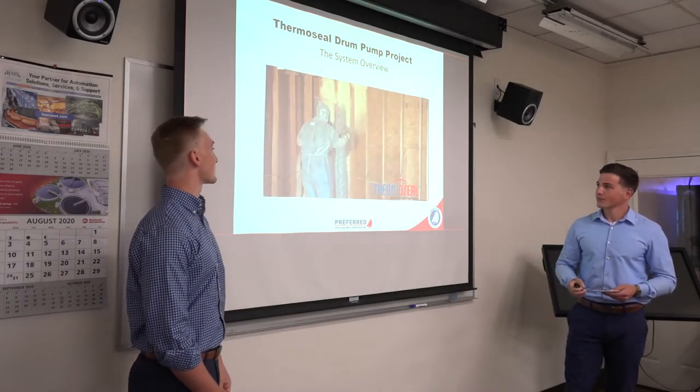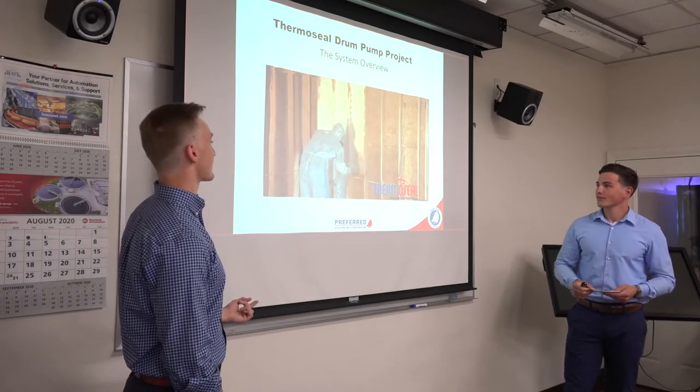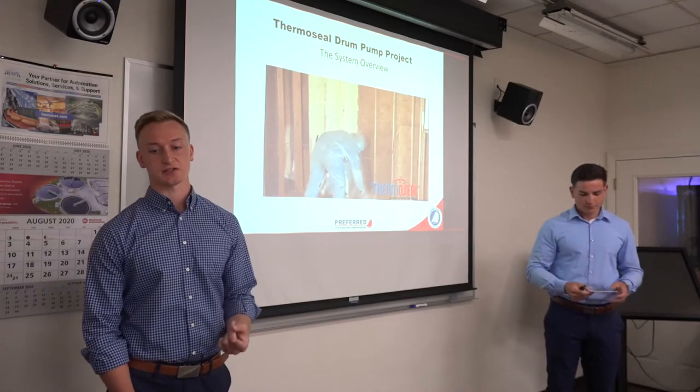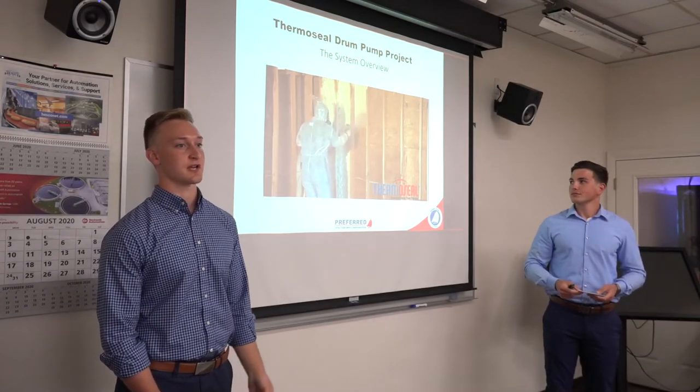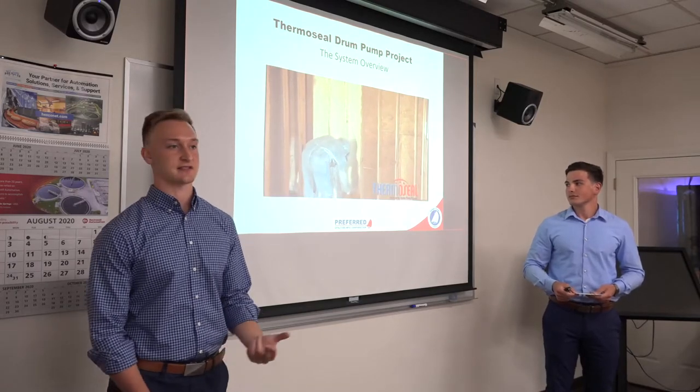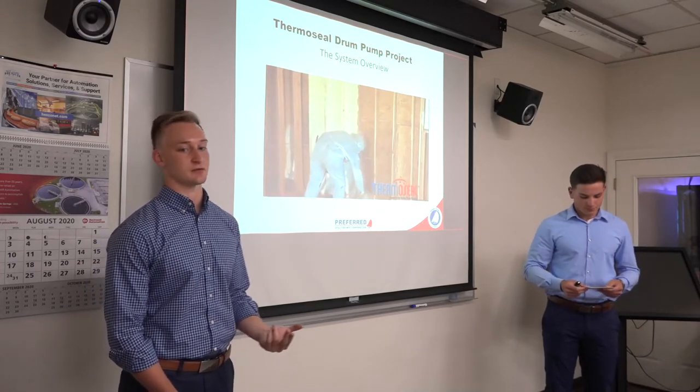Here you can see a short video of the installation process of the spray foam. In the video, as you can see, there's a nozzle, and it's not until the nozzle that the two chemicals actually mix, because they react so quickly that if they mix in the system, it could definitely jam up the system and it wouldn't work anymore.